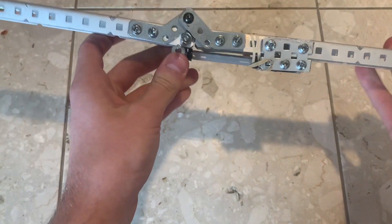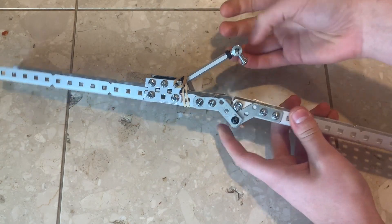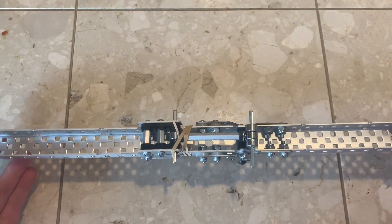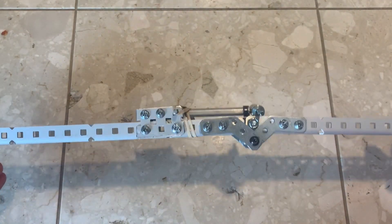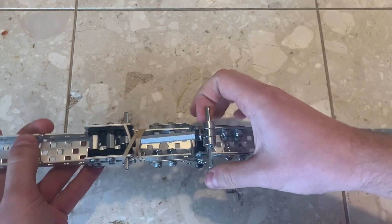The second mechanism is the gusset pivot. The gusset hinge itself pushes the pivot off the plane of the C channel, giving the pivot motion a sort of up and out maneuver which helps prevent the bars from conflicting in the process. The pivot uses an L shaped lock bar with screws on the ends. This is held down by rubber bands and glides over this spacer bar before falling down and locking into place. The screw heads act as sort of teeth to prevent the lock bar from pulling up and letting go. This mechanism does have a bit more slop, but that can be remedied with a little modification to the teeth.